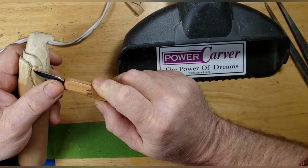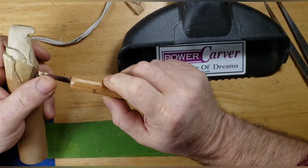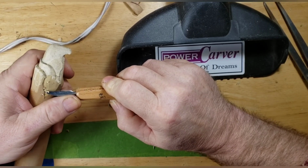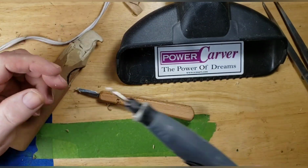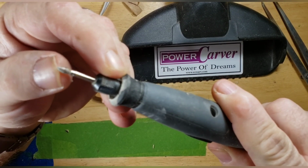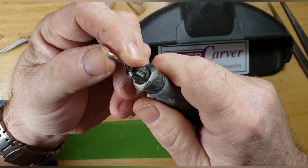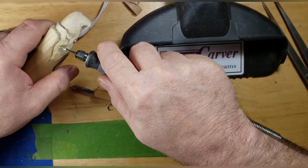It's like a knife, if it's not sharp, it's really not good, right? If it's too dull, you've got to push too hard, and you'll get miscuts and start-stop marks because it's not sharp enough to slide through the wood. So a Dremel cutter is the same way, guys. Like this diamond, you can see it's getting real shiny right here. That means there's no diamond left up there. And what part do we use most on our flame burr? The point, right? Right there on that tip, there's no diamond. I feel no grit. But right here is where the grit starts again. That's great if you're going to use it for sanding and things like that, but up here at the tip, see, it isn't doing anything.